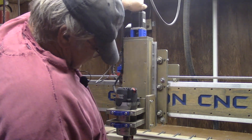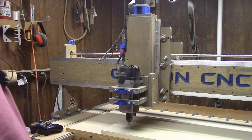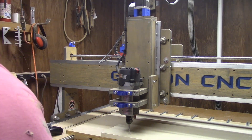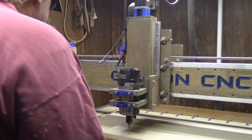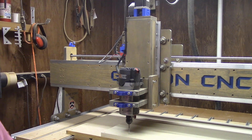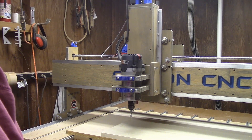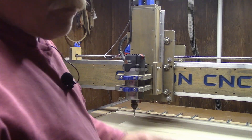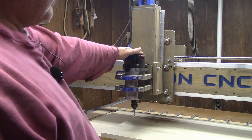The bit is now out of the material, so I won't have any problems. The computer is turned back on, the controller is off. So let's fire up Mach 3 — Mach 3 is now running, we're in a reset condition, I want to keep it that way. Now I turn on the drive box, bring it out of reset mode, bring my Z up, take my Y back a little bit. While the power was off, I shut off the router, because the last thing I wanted was for that router to kick back on when I reset the breaker.